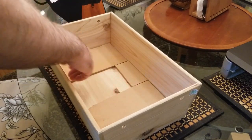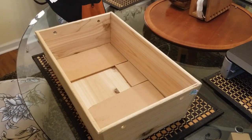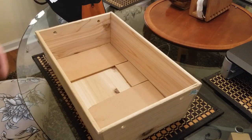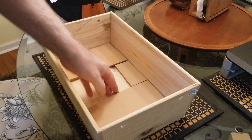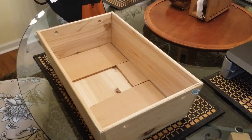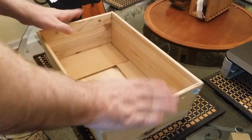And you can see, when you put another piece of wood here, you're gonna have the equivalent of a beveled, or you could say a routed out zone for your trackball. And then you cut a hole right there, the right proper size, you're good to go. And by the way, that square would be, again, I'm reminding you, 3 9/16 inch by 3 9/16 inch. And you're gonna need to glue these pieces to the base of your basket. Hopefully that makes sense. Also, you'd wanna get a board that's cut so that you could slide it in here and get it fit just right.